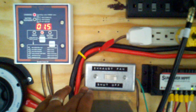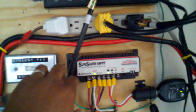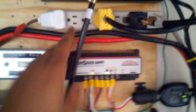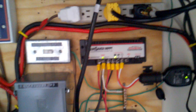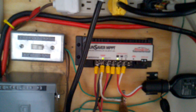I also added a switch that will turn my exhaust fan on and off - it gives me more flexibility. After reading through the National Electrical Code, because this particular charge controller is connected to panels drawing power at over 50 volts open circuit, I had to ground the negative conductor. That is indicated by this white wire on the negative conductor going to earth ground, which satisfies that requirement.